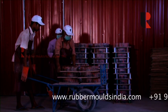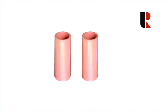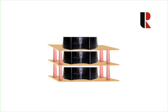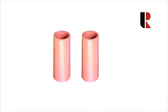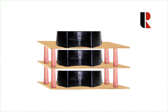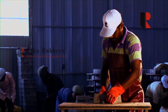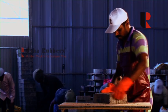The surface used is usually water-resistant marine plywood. The tiles are then stacked on top of each other with separators — generally plastic bushes — placed between the molds to reduce the load on the rubber molds, and kept for 24 hours. The use of plastic bushes or spacers decreases the chances of the mold expanding from prolonged use, thus extending additional usable life for the rubber molds.